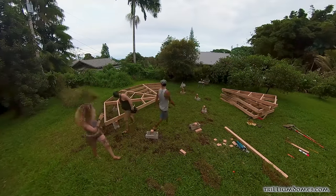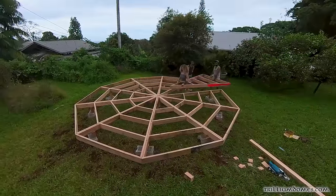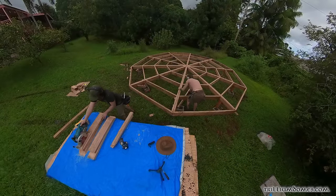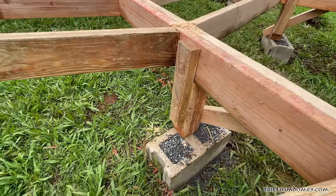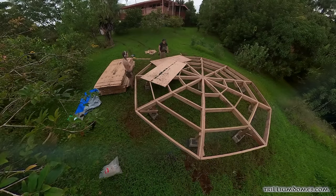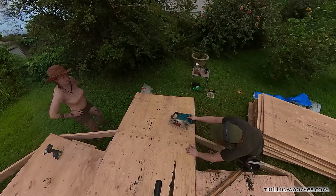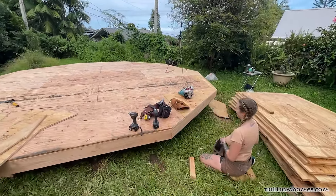Here you can see the pizza slices going together, and it really is as easy as that. The next step was to secure the framing to our posts and add some lateral knee bracing to prevent the deck from moving. We laid out the plywood staggering the seams, just tacking it down — the joists were two feet on center. There were some seams that were a little bigger, so we put blocking underneath those to support the plywood connections. Once all the plywood was tacked on and cut to size, we snapped lines and screwed it in.